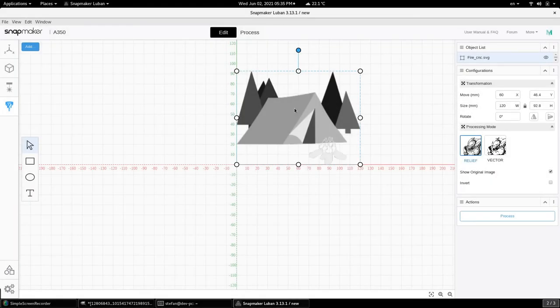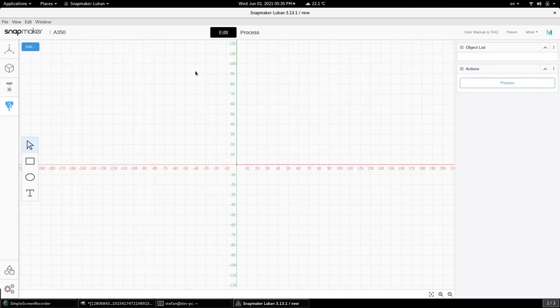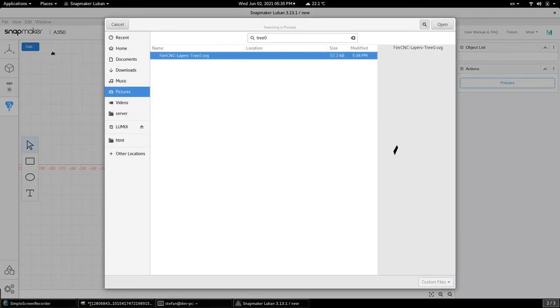Now we're going to the Snapmaker software, and the numbers that we need to remember are these, both the move numbers and one or both of the size numbers. Right now we are in locked proportions, so if we change one it will automatically adjust the others, but if you were in unlocked proportions then we need to remember all four of those numbers. So in any case, let's remove this image and add our tree zero image